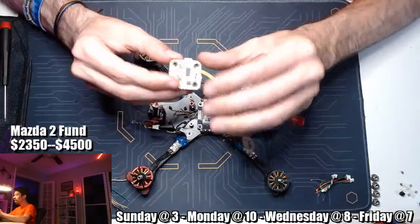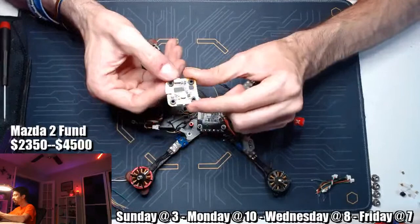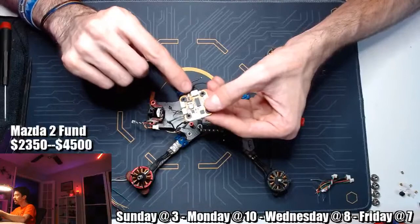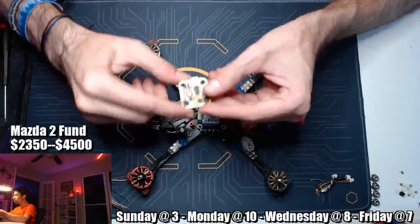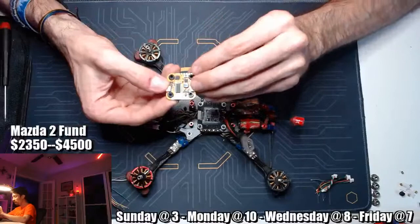So the first thing to figure out when you're installing a flight controller is how you want to orient the flight controller. You can put it like this, you can put it like that, and like that. Typically, to make your life easy, you want the USB port facing left or right. It depends on where you mount this thing, but usually you want this USB port going left or right. So realistically, that means you mount it like this, or like that. So we've gone from 8 options down to 4.